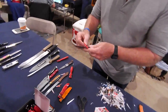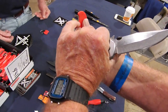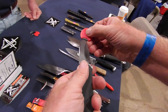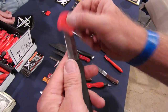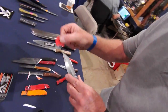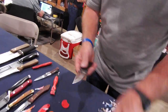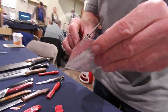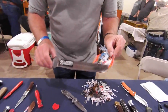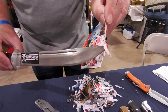The handle is different, but the way you use the carbide is the same. 90-degree corner, 90-degree corner. Touch the 90-degree corner to the cutting edge on a 10-degree bevel up like this, and move the sharpener so you can come out and work on the tip. Come back here on the point of the blade like this — that polishes it. And that's how you make even a hard old Kershaw cut like that. I make even knives this big that sharp — right on the verge of sharp.